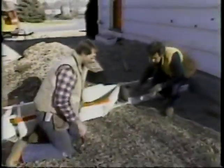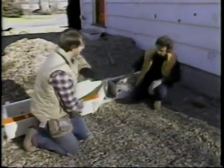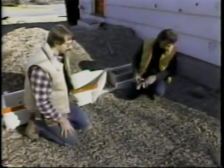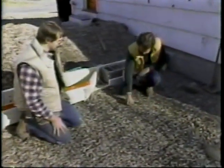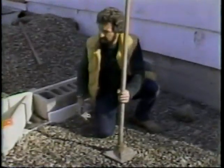All right. Now I see you have all this crushed stone in here. It looks good on the surface, but what's underneath it? Well, we dug out about a foot around this whole area, and it was mostly topsoil. We got it out, and I brought in the 3/4-inch crushed stone. Unfortunately, I ordered about 3 times more than I needed. I can see that. But we tamped it, well, I borrowed this tamper from one of the neighbors who had it around his garage, and we tamped this stuff down well.